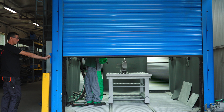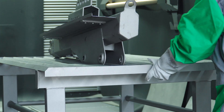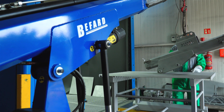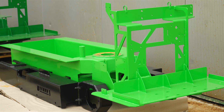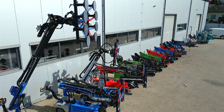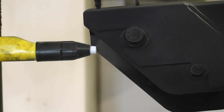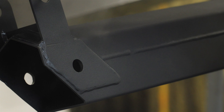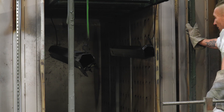The work pieces now travel to a cabin blasting machine, where they are cleaned with high-pressure steel shot. The operator is wearing a special protective visor, which is ventilated with fresh air. Now it's time for painting. In the paint shop, colors such as green, red and blue are applied, but on request, any color can be produced according to RAL. The primer is applied first, then heated in the oven, after which the actual painting takes place. Again, the oven, with a temperature of 180 degrees Celsius. Once dry, the parts are ready for assembly.